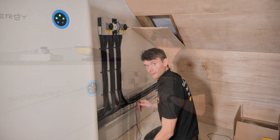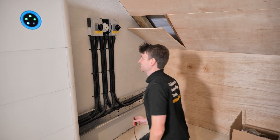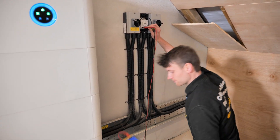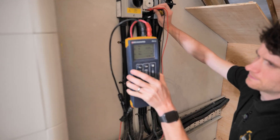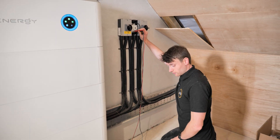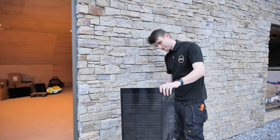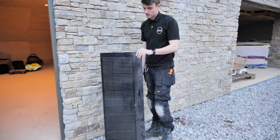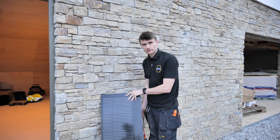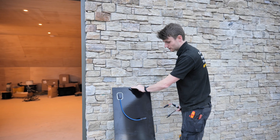The guys have changed that tile - and I won't deceive you, I have already tested it and I know it's fixed, but I'll show you now. That new tile is in our measurement and we've got 340 volts - it's come down a little bit because it's getting dark. So that's now fixed - gone from zero to 340-odd volts, all because of one panel. Here is the offending article: a 60-watt solar tile. The challenge with solar tiles is that you have so many of them, so the chance of failure is higher.